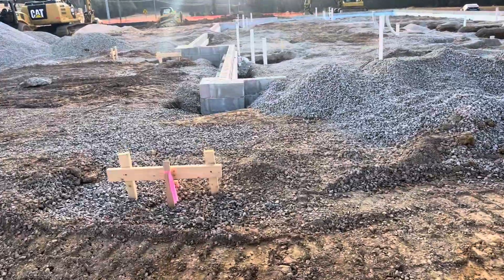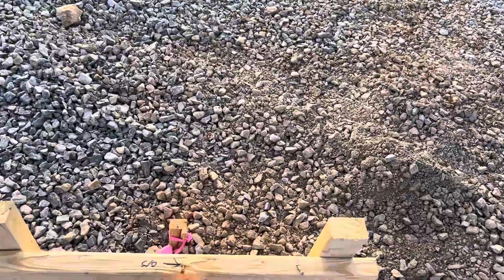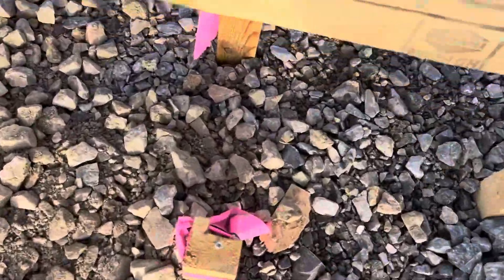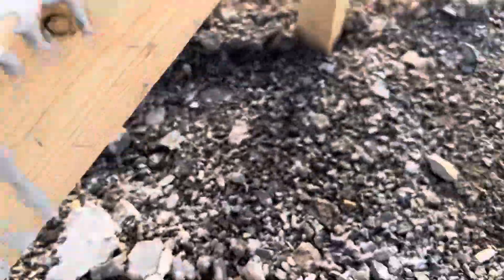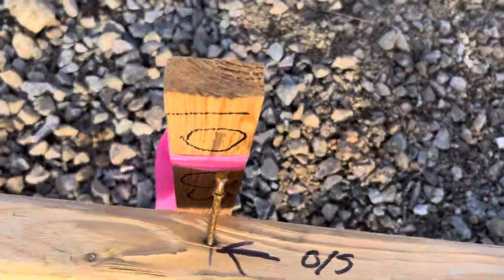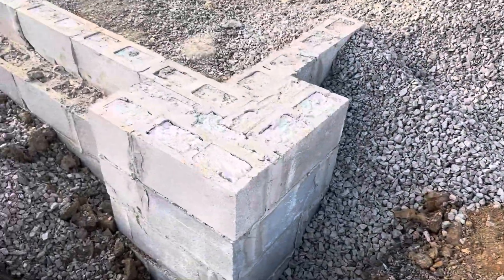You can see that is the layout for the exterior wall. That's the pin — there's a screw here — same thing here. That is the pin, and 10-foot offset from that corner. Same thing, 10-foot offset — that is the pin, 10-foot offset from that corner. So we know that's the corner.